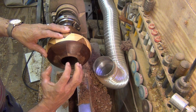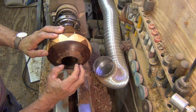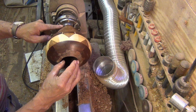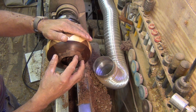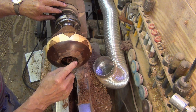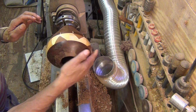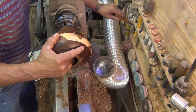shouldn't do this on the expansion mode, because you have a chance of splitting the seams on the wood. But I might need this piece here for a while. I will fit it all and dry fit it and then put it aside at this point, because like I said, I might need this, and then when it's all assembled I can very well place it back in and just sand it and buff it without cutting and putting too much pressure on anything on this.